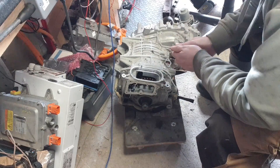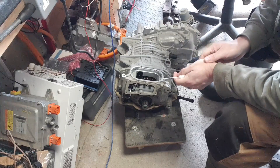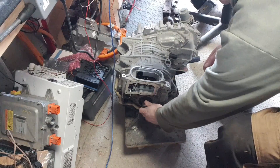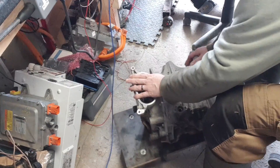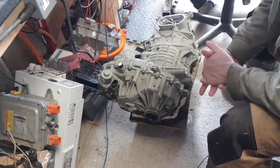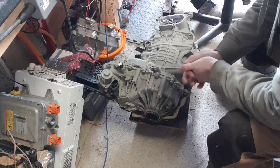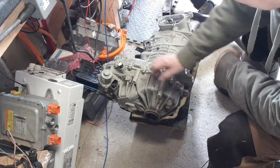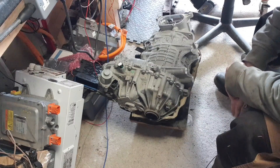The resolver and temperature sensor connector is on the back here - I've got to work out what that plug is, by the way. The drive shaft for this side actually goes down the middle of the motor, so we've got a male drive shaft here on one end. Turning the drive unit around the other way, there's a female end, so the drive shafts are running on the same axis as the motor. There's a little gearbox and presumably a reduction gear, differential, some kind of parking pawl actuator going on, along with various mountings.